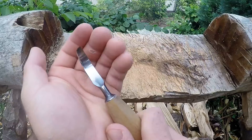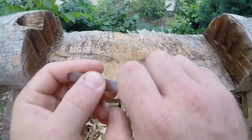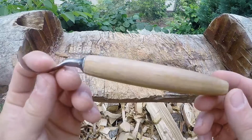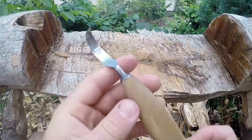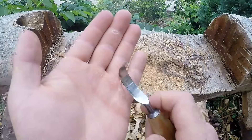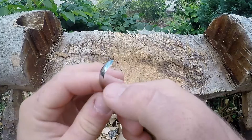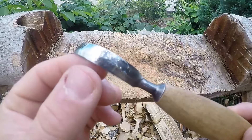I sometimes do Tukacam-style carving with this knife, and I've rounded off the edges because I tend to choke up on it quite a bit. I've thought about putting a longer handle on it — that would serve as a kind of hybrid Tukacam setup. The method I use it with now, more in a turning or peeling manner, means the outside convex edge is perfectly suited for this kind of carving, while the inside is flat. Both sides are polished since I mainly use strops and never really let it get dull.